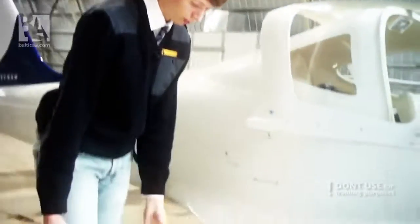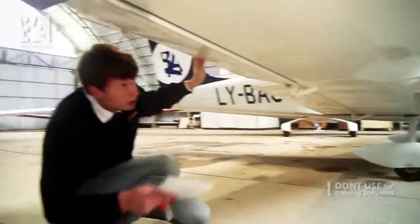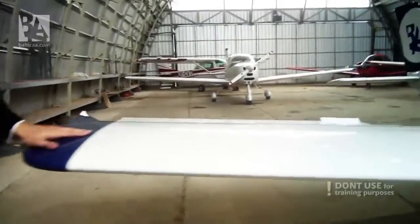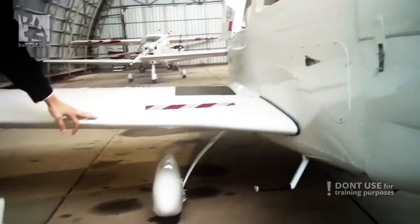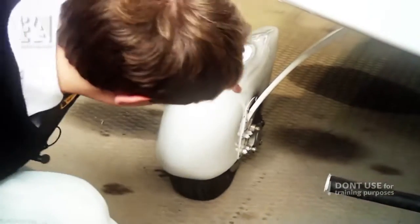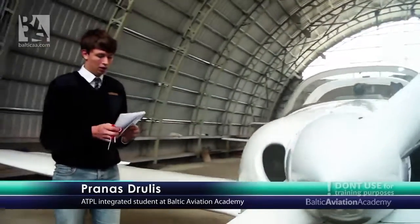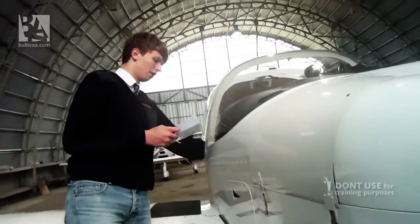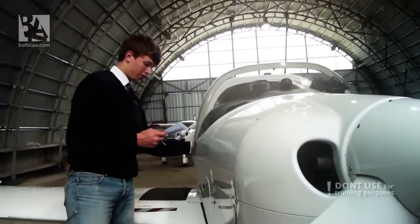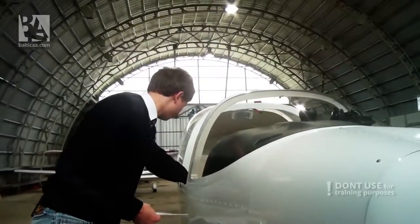And absolutely the same on the right hand wing. Condition is okay, no cracks, all rivets are in place. The light is just fine, and same for the leading edge. The last thing on our right wing is the tire — everything looks perfectly normal. After that we continue on the engine area. We check that the parking brake is on, that the magnetos are off, the master switch is off, and that the throttle is fully idle. Now I can stow away the pitot cover.